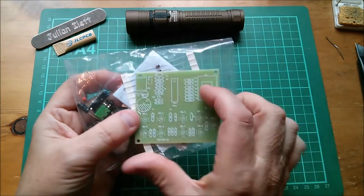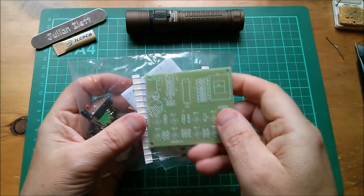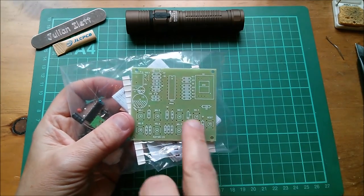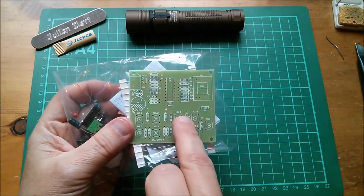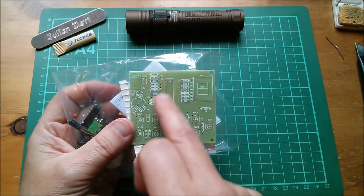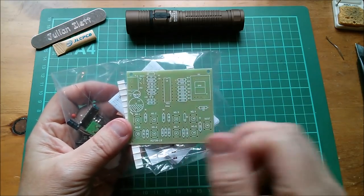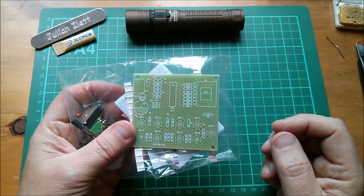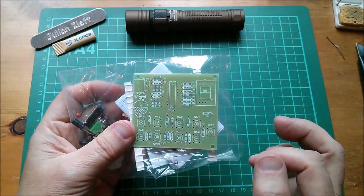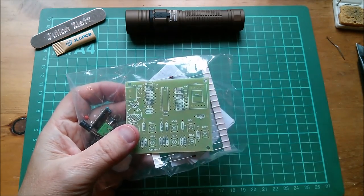But I was looking at this and I was thinking, how have they done this? Because there are masses of diodes. They supply all these diodes. So I think they've got a sort of encoding diode matrix on the switches so that when you press these buttons, it encodes it into BCD. And then, of course, the chip decodes that and recodes it into a 7-segment display. And I just thought this was a bit of an oddity. But yeah, that'll be fun to build. I'll do that as a kit build video at some point. Yeah, I'm quite looking forward to that.